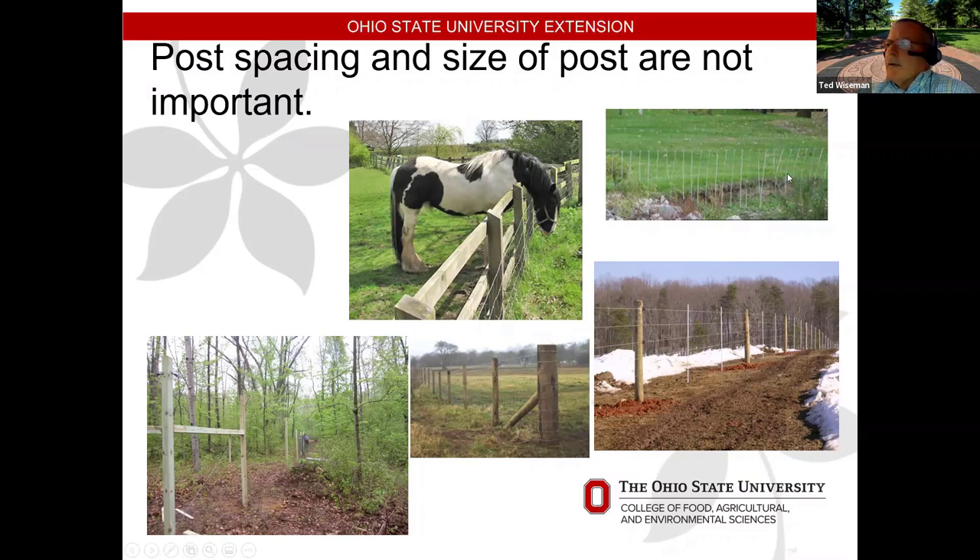Here's an example of a simple water gate that won't snag a lot of trash coming down the creek. These hanging wires are electrified. A lot of guys put a switch at the edge of the fence line — if rain is coming, they flip it off so there's no juice and it's not grounding the charger. The one in the bottom left corner looks more like a wildlife exclusion based on its height. Corner posts are solid with decent spacing — it's probably going to be a good fence.